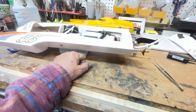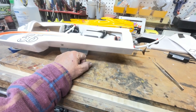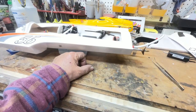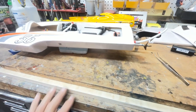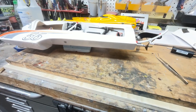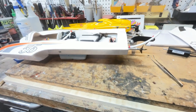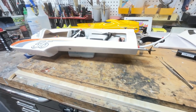That's probably 140 pounds of force — it's 10 times the weight of the boat — going through there. And the little brass sleeve didn't look very big or very meaty. If it was a big, meaty stainless steel thing, it might have had better luck. But I don't think the engineers at TP were planning on thrust loads going through that piece of brass. That's why it exploded into a billion pieces. Anyway, it's a good learning experience for all of us to see just what can happen.